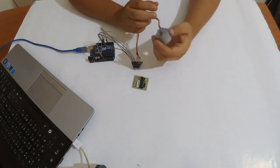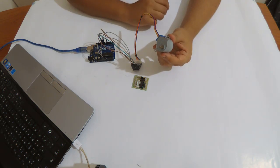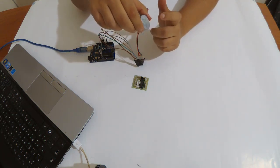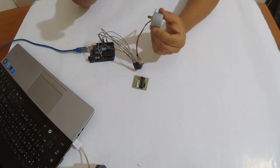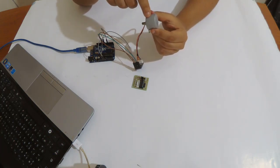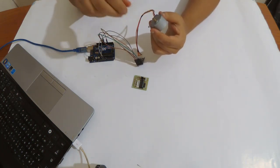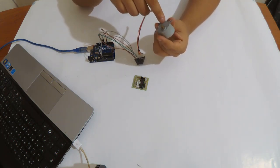The functions on how to use this are pretty simple. We have to include the library stepper.h, and we have to know the number of steps of this motor — this motor has 2050 steps. Some motors may have a different number of steps, so we should define this number in the code. There is also the setSpeed function, which lets you set the speed of the motor. In the code I used a speed of nine.